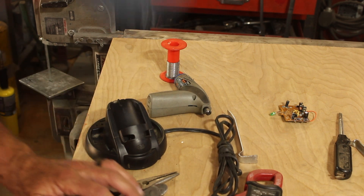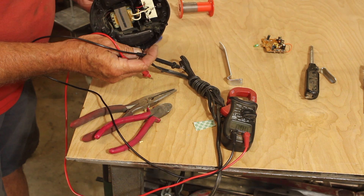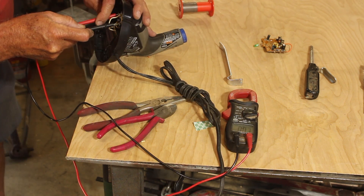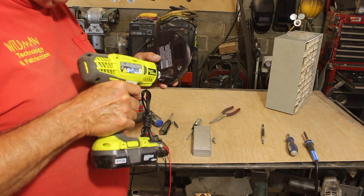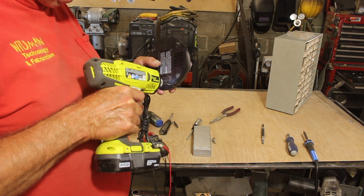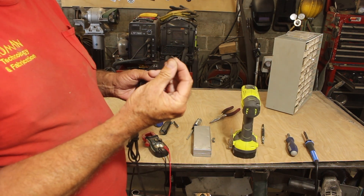Let's make sure we still have our voltage — 16 volts. Put the load on it. Okay, it came down to 7 volts. That's perfect. Now put this back together with all those triangle head screws. Don't forget to glue those rubber feet back on. That's actually a much better repair than just jumping across to the terminals. Because who knows what is fried in here.